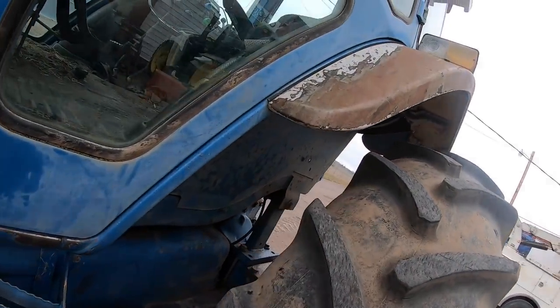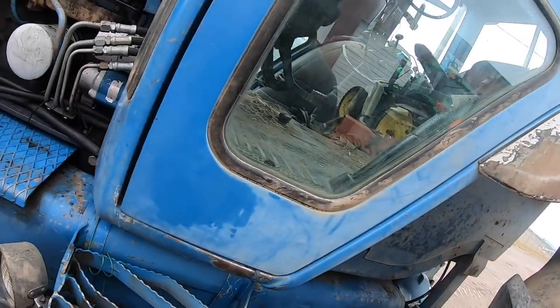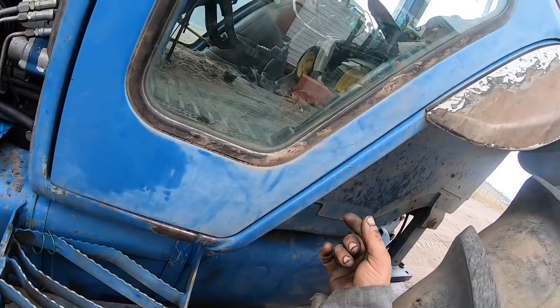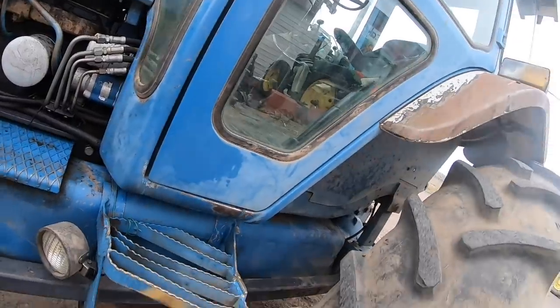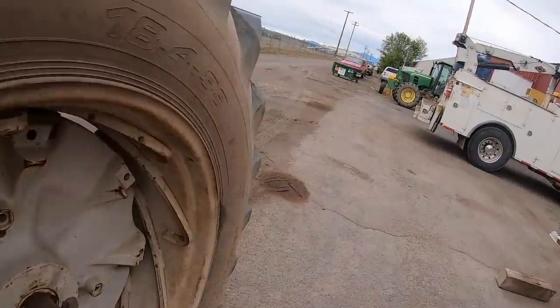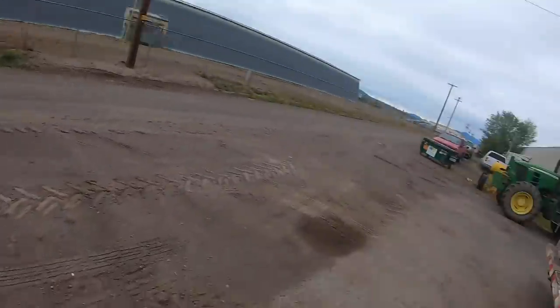and then I just pull the cabs on these. I mean, everything has to come off. Fuel tanks have to come off. Then you've got to pull the transmission off the rear end, pull that snap ring, pull the shaft clear out the front, and order the shaft and replace it. This will be the third one I've put in this tractor. I keep telling him to get rid of this piece of shit, but he loves it.